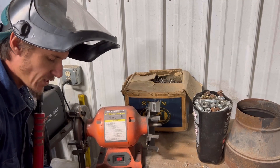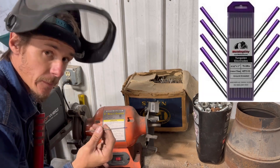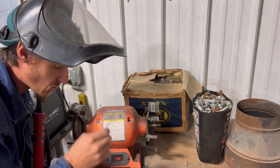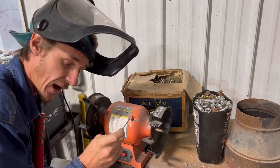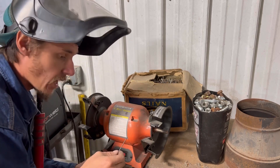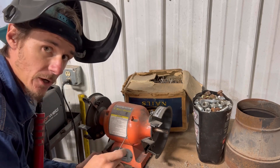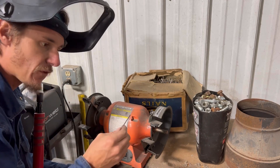If you're using an inverter machine, I do prefer a purple rare earth E3 tungsten — it just works better for me. You want to make sure there are no cracks in your tungsten from the previous time you used it, which in my case there were. So I had to grind a little bit off. You don't want to break it because that will create new cracks. Just go ahead and grind it to a dull point — it's not like a traditional machine where you leave it flat and let it ball up on its own. This thing usually won't ball up too well.